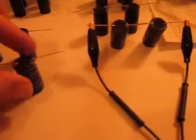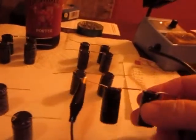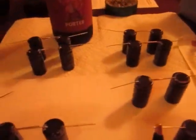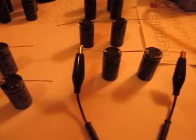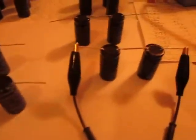Here's the deal. If I put one of these in my ESR tester, it's going to come in at around 3080. When I take two of them and solder them together negative to negative — one is going forward, one is going backwards — I've basically made a non-polar NP bipolar capacitor. By putting two 3300s together, or actually closer to 3100, you take 3100 divided by 2, which is what you're doing by putting them like this.